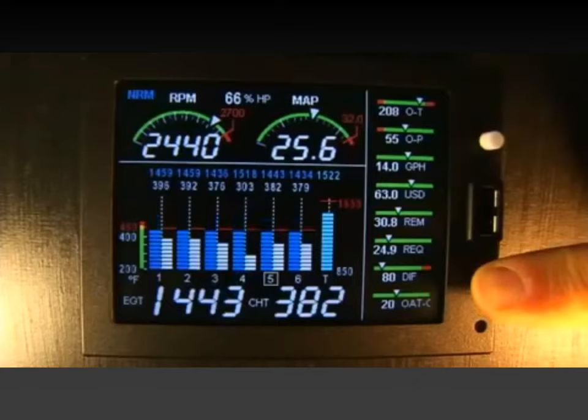So the procedure for run-up is, as you've seen here, hold the change button, the lean find button, down for 3 seconds. Then you get all EGTs centered in the center of the screen, and then switch to left mag, and all blue bars should come up. If one blue bar does not come up, you have a bad plug. Bring it back to both, all blue bars come back down. Perfect. Switch to right mag, all blue bars should be coming up. If one doesn't come up, we have a problem. Back to both, all blue bars come back down. And then hold the button again for 3 seconds to restore normal view. So normalized view is super helpful for the mag check on run-up.